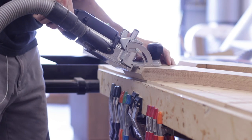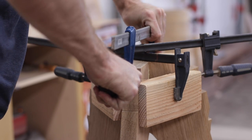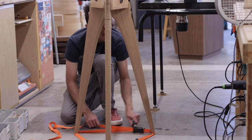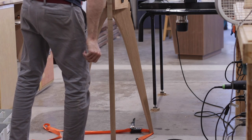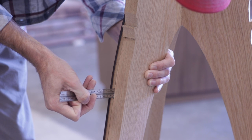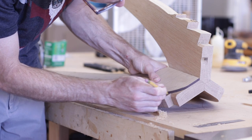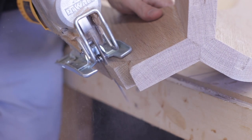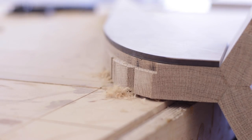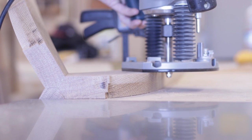So with that, I can cut in some dominoes, which are pretty much only for alignment. And I actually don't cut dominoes into one of the joints just to make it easier to get everything together during the glue up. The glue up requires some clamping blocks around the top to get the proper pressure, as well as to tighten the clamps as evenly as possible. I'll also add a strap clamp around the bottom of the base to ensure that the bottom of the joint doesn't start to open up. After the glue up, I had to get rid of the portion that I left for the clamps, so I first needed to trim down my template to get it to fit properly.